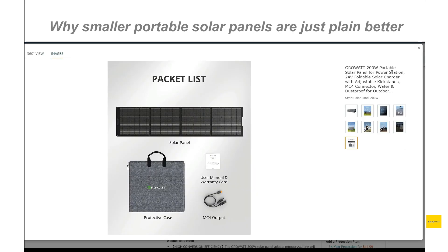If you have a power station with a higher voltage limit - around 50 volts or above - you can hook the panels up in series. With series, you don't even need any connectors or adapters. You just take the positive from one panel and connect it to the negative on the other panel, then use the remaining two ends with the MC4 adapter that your power station came with. It's really easy.